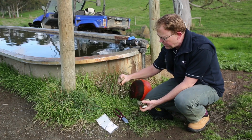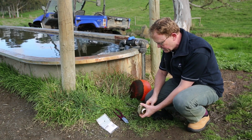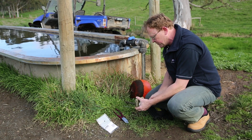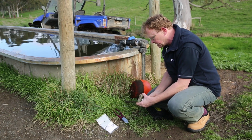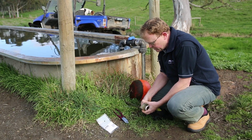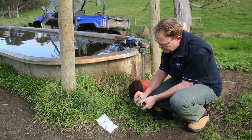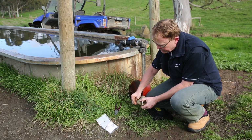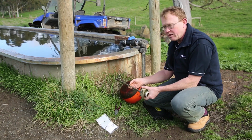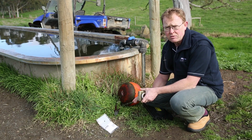Then a question of grabbing the cam and the arm, and once again, same thing, grab the clevis pin and simply slide that clevis pin through. This one's probably a little bit more difficult, but get that through, just line that up like that, push that through, and again, the same thing, grab the pin, hopefully you've left it in a position you can find it, slip that R pin through like that, all the way through. Terrific. Just check that all looks really good. So this valve is ready to reinstall, and we are good to go for another 2 or 3 seasons.